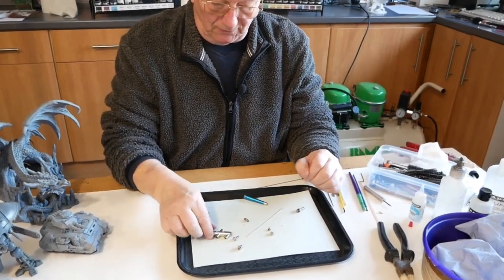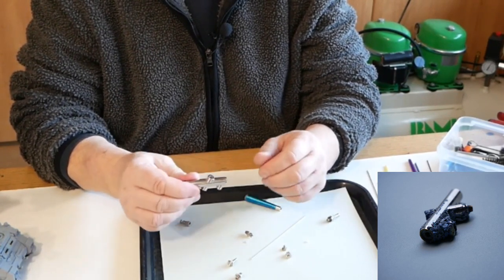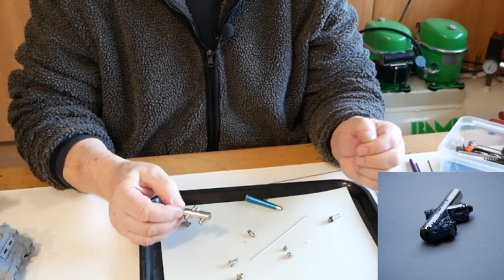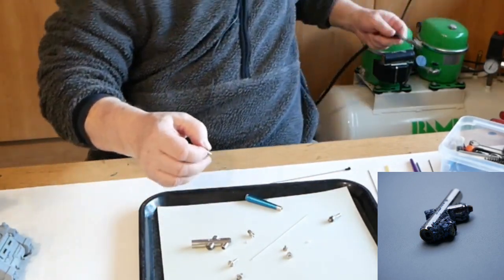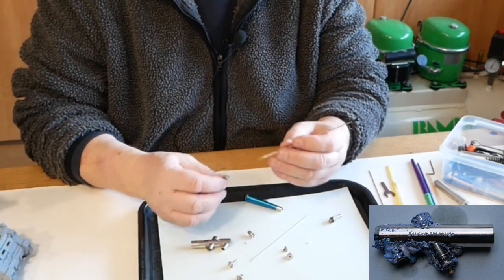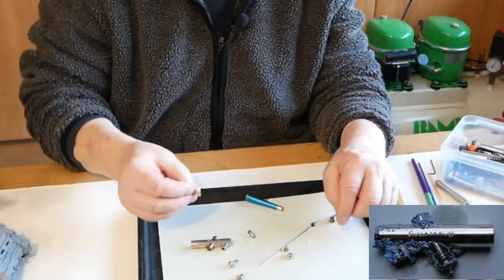This airbrush was in to soak for about three days and it did look quite a state — I'll put a picture or two in so you can see what it was really like. Unfortunately I didn't get a video of it, but it's all been cleaned off now. When I blow the airbrushes off I just put this onto a quick disconnect, turn the air on and give it a good blow. One thing you do have to be careful about: when using a plug to blow off, they do have washers in them, so take these out, then blow it, and then remember to put the washer back into the quick disconnect plug.